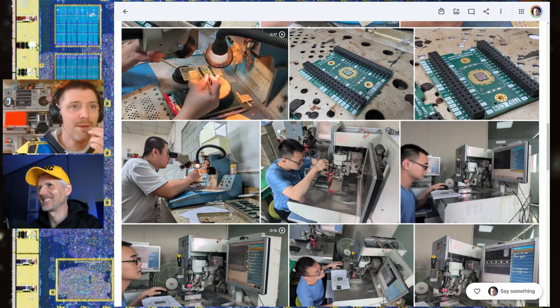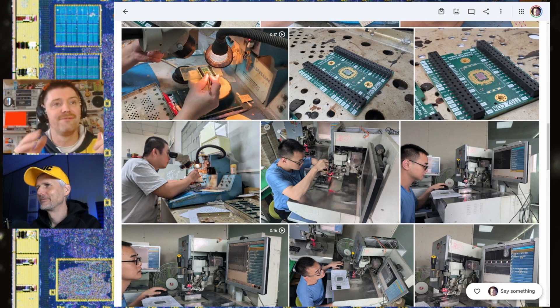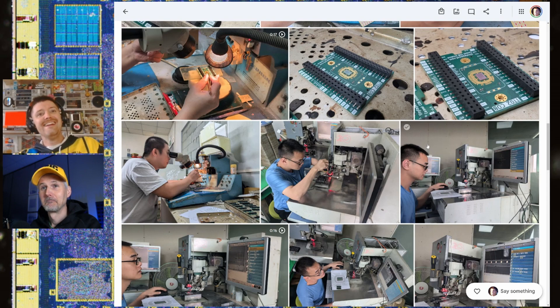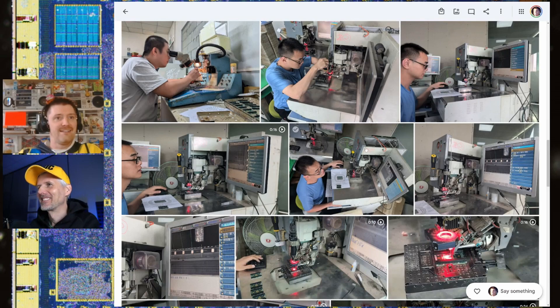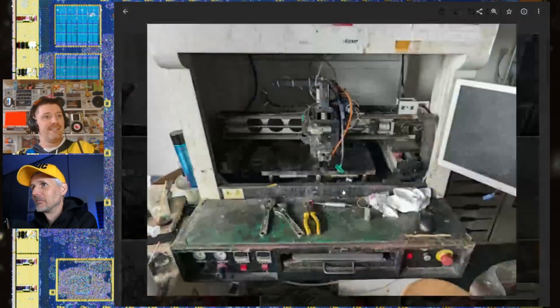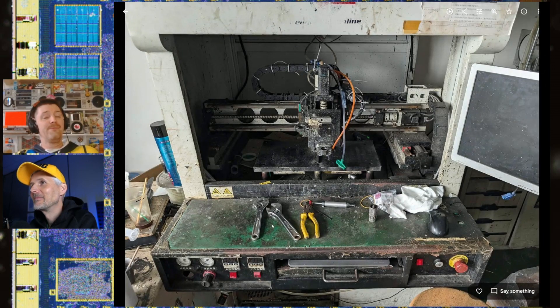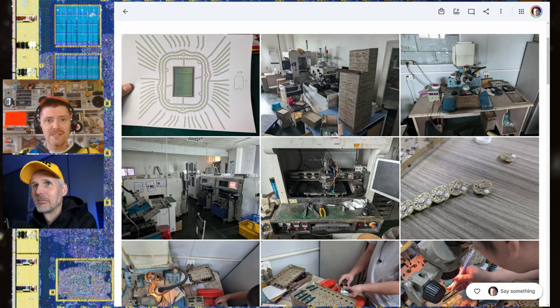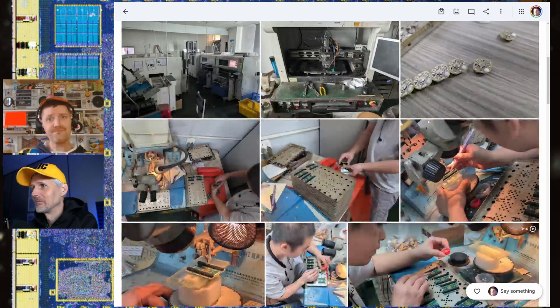What was really interesting was the stark contrast between where the chips are fabricated — in an ultra-clean foundry — and this factory, which is not a clean room by any means. You can see one area where they do automatic gluing on boards — it's clearly well-used equipment. But as mentioned in the blog post, the results spoke for themselves: they had less than one percent bond fail rate out of almost two thousand wire bonds. Perfectly good for their purposes.